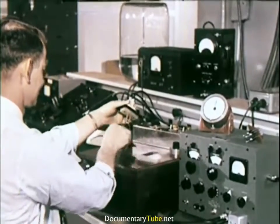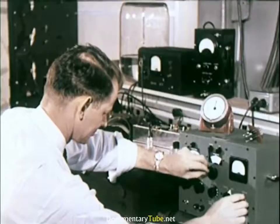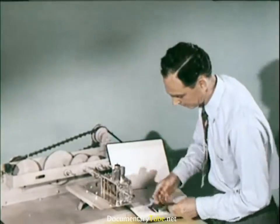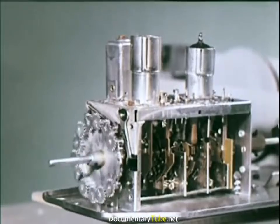An average capacitor must be able to withstand at least twice its rated voltage and is also tested to measure stability under various temperature changes. All switches, relays, and bearings are mechanically tested to make sure that they are able to withstand the equivalent of up to 10 years' wear.